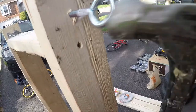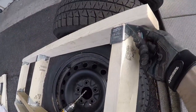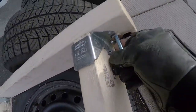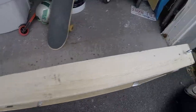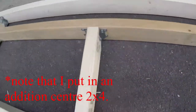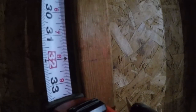The size of eyelet you buy is going to dictate the size of hole you're going to need. Then put a large washer on the back side so that the nut doesn't pull through when you tighten it up. You can see a pretty simple frame and the two eyelets that are going to hold the steel wire rope so the side that's away from the wall doesn't start drooping down once you put the tires on it.